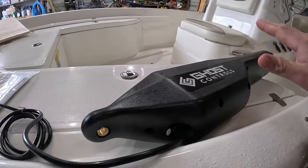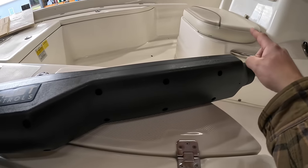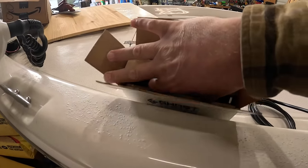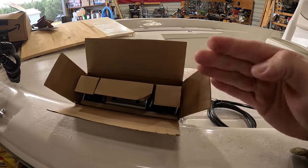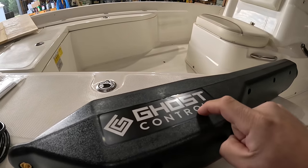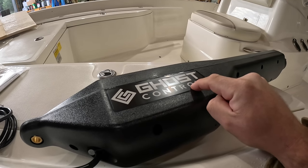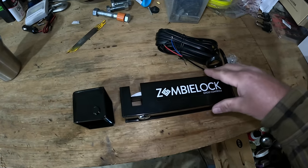All right, so if we take a look real quick, I've already been pulling stuff out of the box and eyeballing everything. You wanna pay attention to the way this stuff mounts, the types of mounts that are included, and then go through the owner's manual and see, you know, what side of the post this has to be mounted on, because all this is going to make a little bit of a difference on how we set this gate up. And it recommends that this operator control be as almost dead center of the gate as can be, and that's vertically.